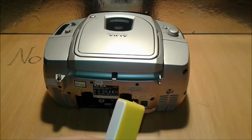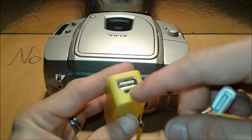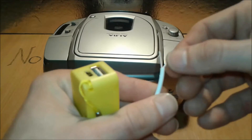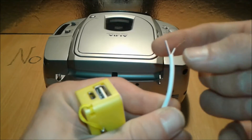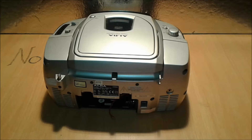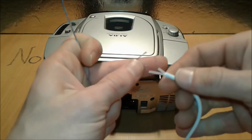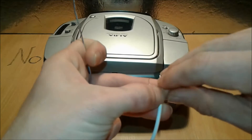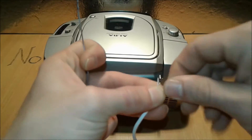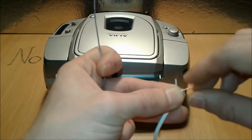For this experiment we need the original adapter — USB on one side and micro USB on the other. We cut it in half, identified the minus and the plus wires, and we're going to use two wires to extend the small leads. We'll solder them and isolate them so they don't touch and create a short circuit that could destroy the power bank.